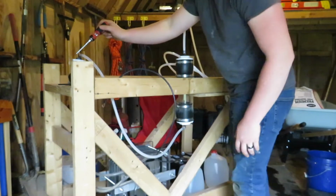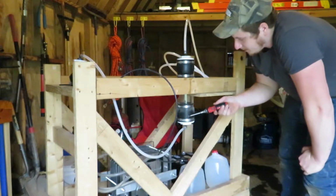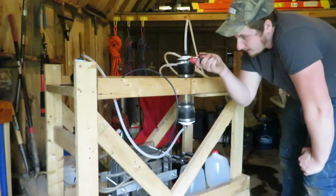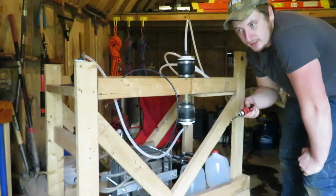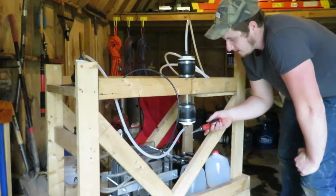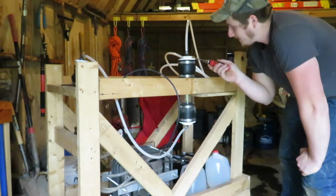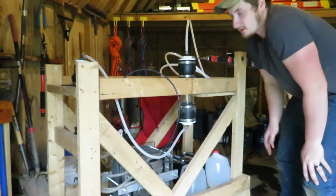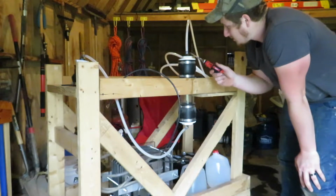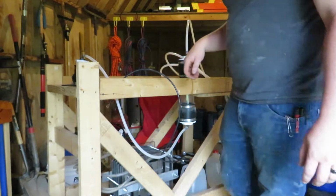Yes, so it's coming out of this main tube here, and the hydrogen and oxygen mixture is coming up in through here. In here there will be distilled water to purify, to get the excess potassium hydroxide, which is going to be mixed into the hydrogen gas. So this here pretty much tries to take that out a little bit. Plus the bubbler, it's a safety feature, that way there's no flashbacks, because if there is a flashback and this wasn't here, this whole thing would explode. So this here is basically a safety feature and a filter at the same time. So that's what that is.